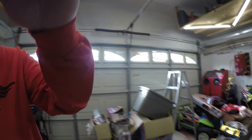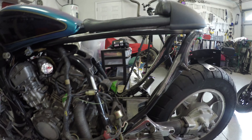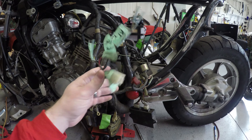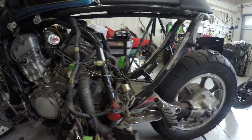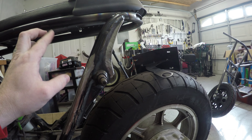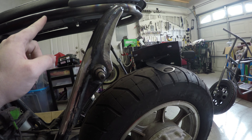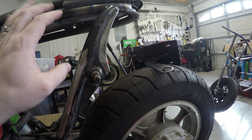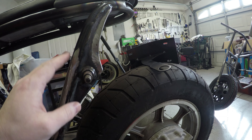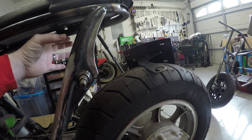Let me give you a better view of the bike. So here's what we're working with right now. We've got all these electronics — the CDI, all the nanny state stuff, the flasher relay, the ground, all that. And then we also have to have a spot to mount our battery. So my goal today in this episode is to build a gusset that runs from this bar to this bar, with some dimple die holes in it to add rigidity. And it will complete this corner and give us a hidden spot for our battery.